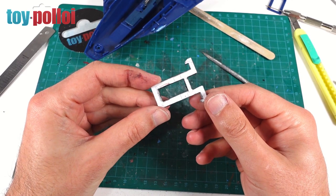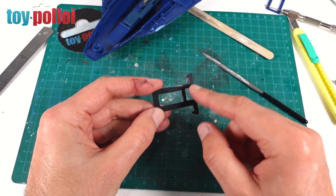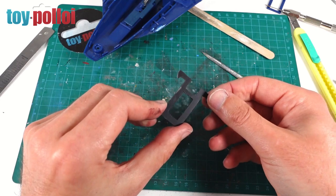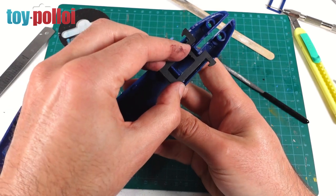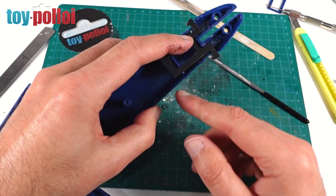Okay, I'm starting to get a shape I'm quite happy with. As you can see, it takes a little bit of time, especially to cut out that middle hole, just because it's a bit awkward. The best way to do it is to drill a load of holes around the edge and then start scoring it. But you can see I've now got this shape that does fit very nicely where that original fixing should go. And you can see it slides back and forwards, which is what you need to have it do, because that's how the wing mechanisms work.